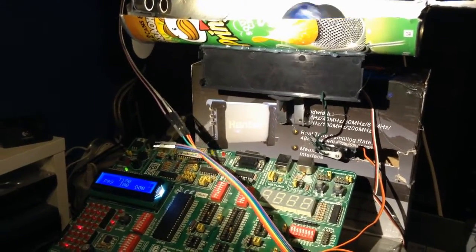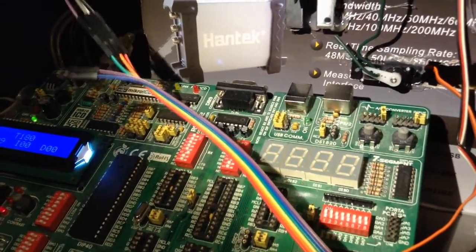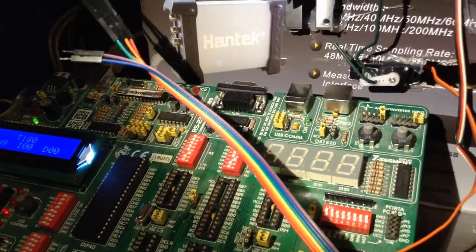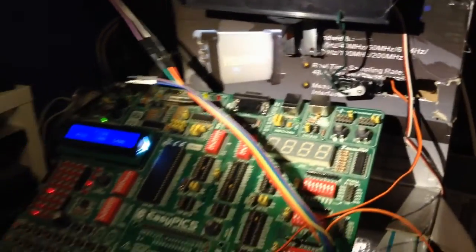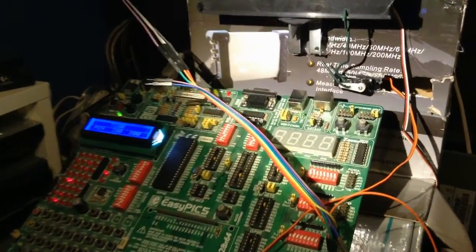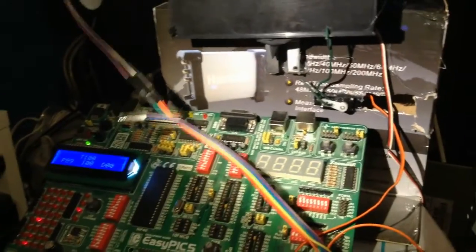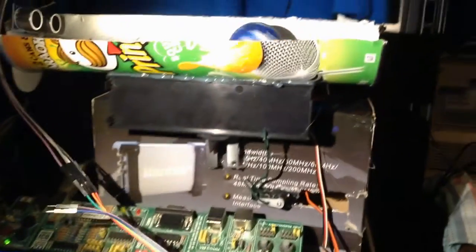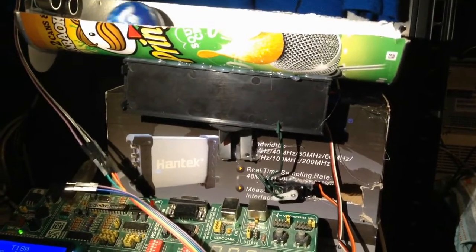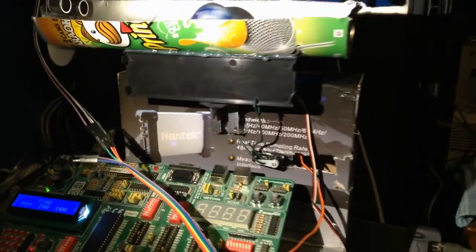we can have a higher resolution on the signals going out to the servo. Also remember, this servo is an analog device. It doesn't have any steps, it has an infinite number of steps. So it's a matter of digital to analog conversion to make the resolution high enough. So what I've done is increase the resolution by 3 times. We'll have a look at that.